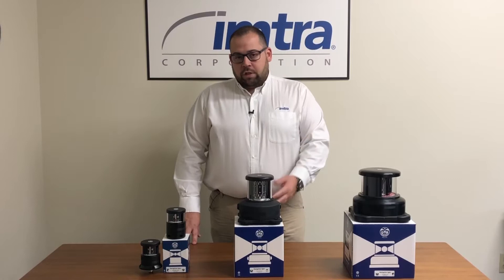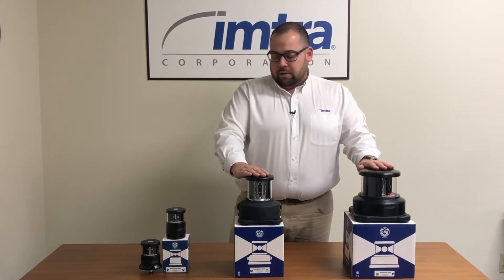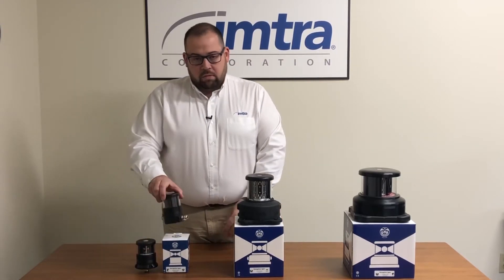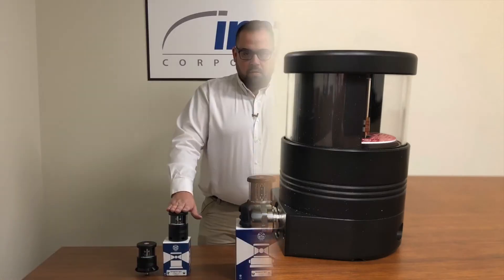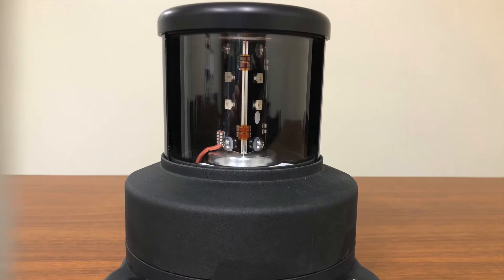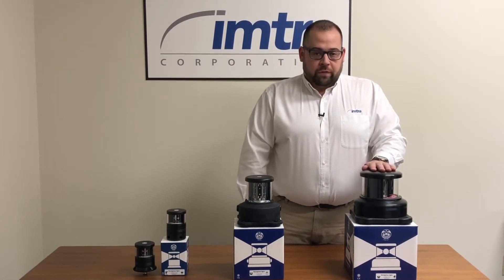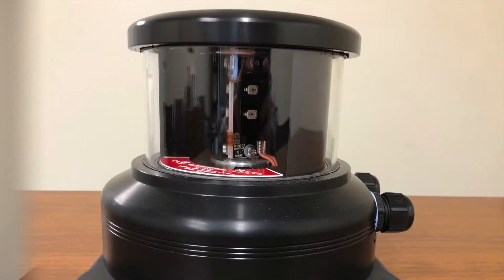They offer three versions of LED navigation lights starting with the DHR 40, 60, and 80 series. The DHR 40 series is available in a base mount or side mount and is for vessels up to 50 meters or 164 feet. The DHR 60 is a primary secondary unit, also known as a stacked unit, which has a built-in backup if an LED fails, and is also for vessels up to 50 meters or 164 feet. The DHR 80 is for vessels over 50 meters or 164 feet and also has the primary secondary stacked option available.